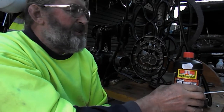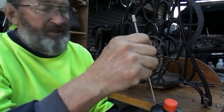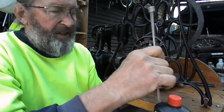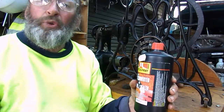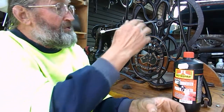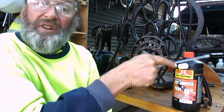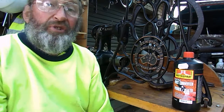The tip when you use it is: when you're actually putting it on, don't dip your brush in the container and paint directly from it. Because once you get a bit of metal or rust off that into the actual container, it will start activating and the whole lot will go off. So you tip a bit out into a cup and use that cup. When you've used it all, you tip a little bit more in. That way you're keeping the container basically in its original, non-activated or virgin state.